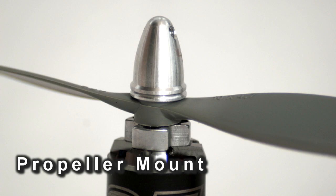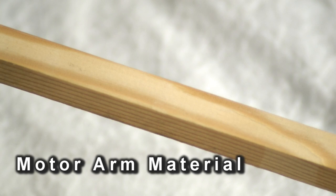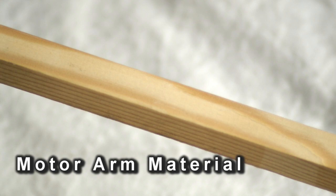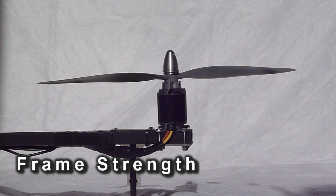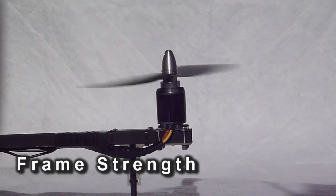The prop mounts are very important as well. They need to be solid and well engineered, and I only use the ones that bolt onto the motor to make sure you've got a solid connection between the prop and the motor. I prefer to use wood for my motor arms — it's light, quite strong, easy to work, and fairly cheap to repair if you break one. Wood also dampens vibration quite well. The central frames which hold the arms together are made of 1.5mm fibreglass sheet, which is very tough and rigid. The motor arms need to be physically strong enough to stop any flex, and on the quadcopter the arm section is much larger to keep the motor held firmly in place.